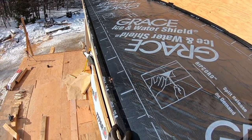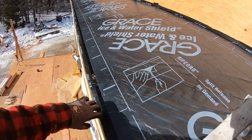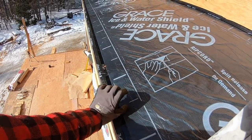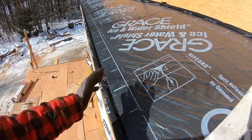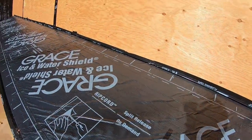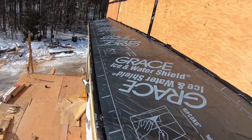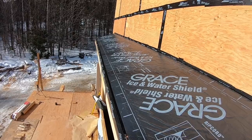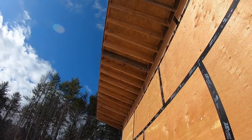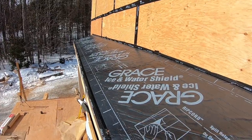this is the subfascia. I'm going to have a 2-inch blocking here all the way around, little bullnose kind of thing in plane with this, coplanar to this subfascia. And then there'll be 2-inch rigid foam on top of this, strapping, half inch or probably inch strapping, and then the roofing, little length of roofing all the way across. And flashing and all that stuff that I'm supposed to have, so it should be good. It will be good. It's gonna be a bomber little roof that's completely under another roof, literally completely under another roof. So it's overkill, but it's way better to overkill than underkill.